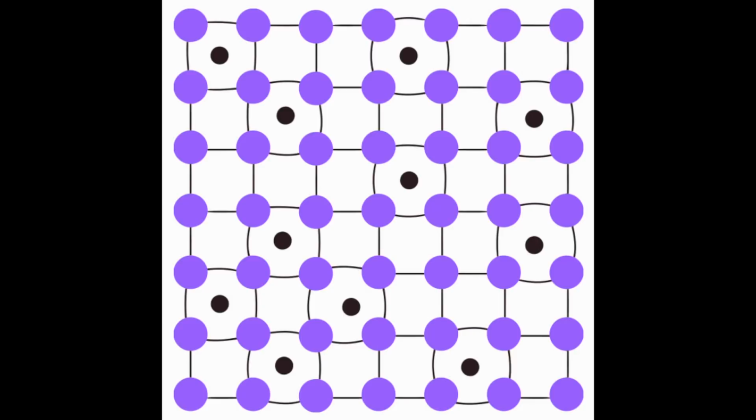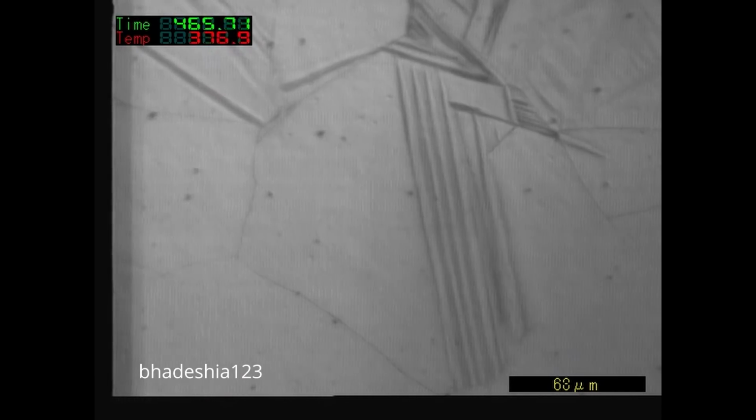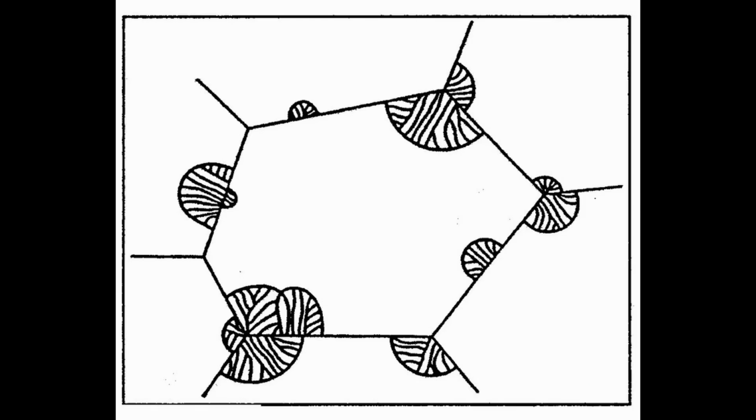When we rapidly quench the steel, we lock in the carbon and make this distorted structure called martensite, which is very high in hardness. However, if we slow cool, it allows the carbon to come out. It comes out as this phase called pearlite, which is a combination of ferrite and carbide, just like our annealed steel. But it forms in this unique structure because it wants to form both at the same time as we slow cool. And the pearlite is soft and undesirable if we want a nice hard knife blade.